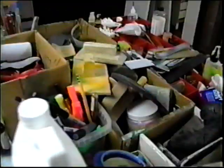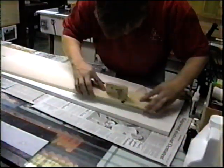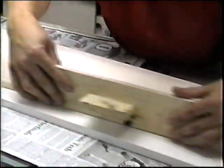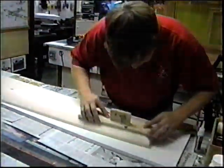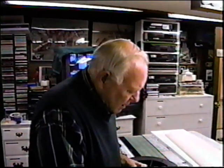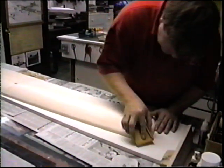That's why it's always good we have this whole box of sanding blocks to work with. Remember, you're sanding every wing that'll ever come out of this mold. And we already have two molds that are producing relatively nice wings. In fact, Woody's got the other one. He even crashed it. He was so mad at the wing. He said, plane doesn't fly itself. He's got to fly it. Well, we can't design that into the plane, unfortunately.